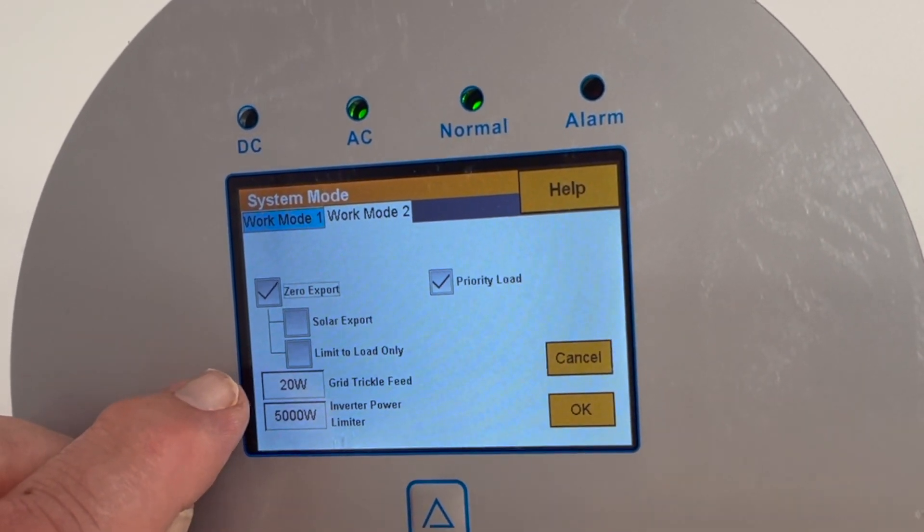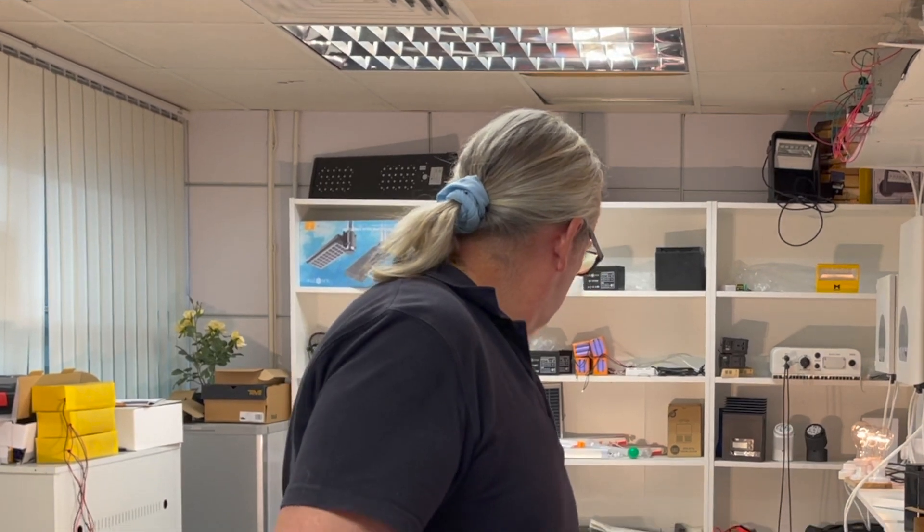This 20 watts is the power actually pulling from the grid at any one time — the reason for that is because of prepaid meters. When you go into auxiliary load, you set your micro inverter upper and lower limits, and you also set your battery settings correctly. All the other settings — you've got to make sure you've got communication with your batteries, very very important. As long as your inverter is communicating with the battery, this system will work, and I'm proving it here.